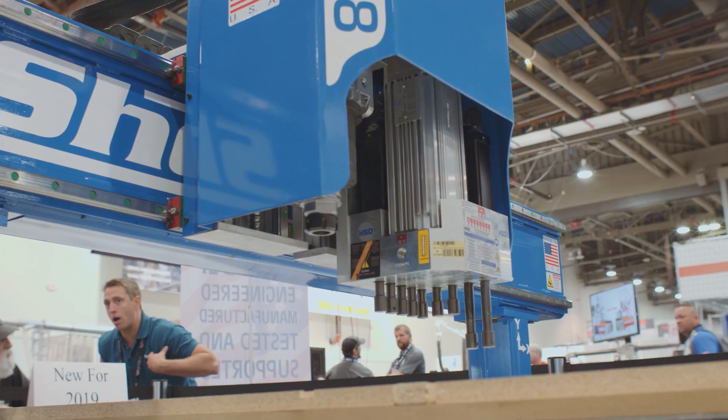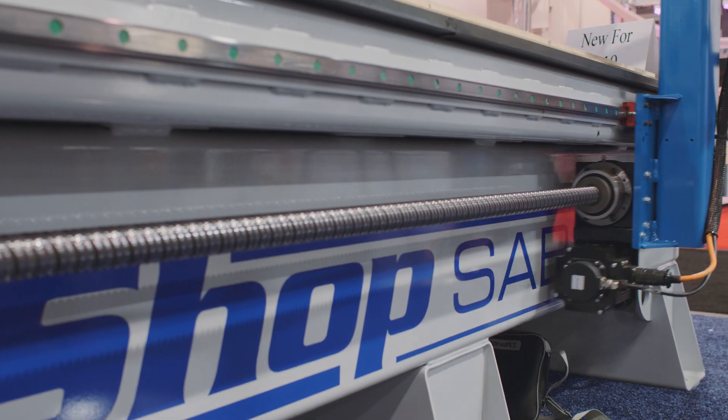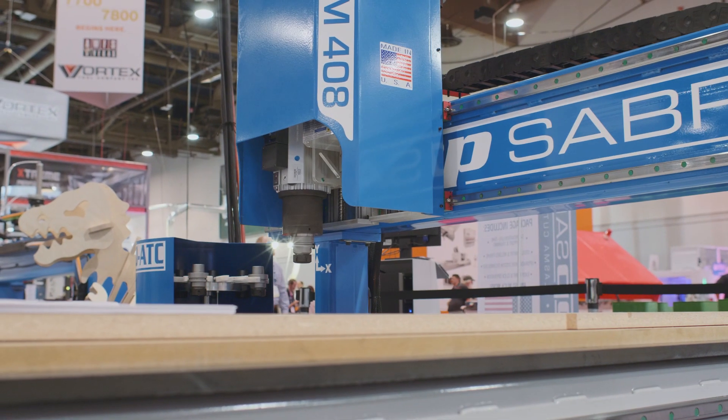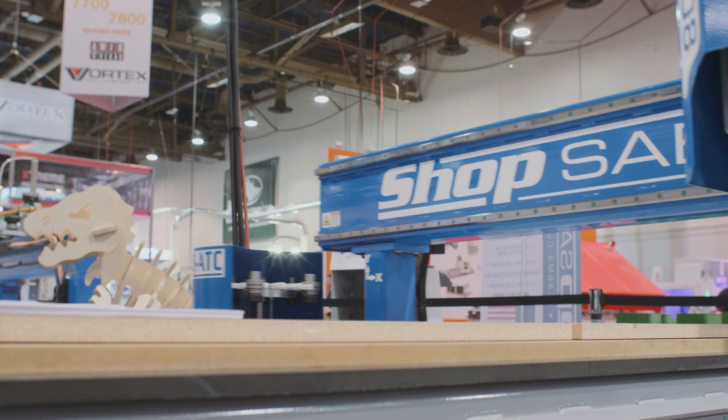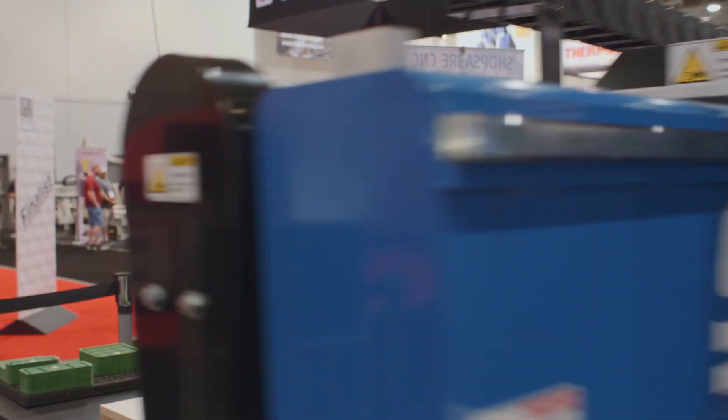How in the world did they do it? It's all about data handling. Think about what you've got in the control — different parts all connected with fiber optic, so the transfer of data in there is lightning speed. Then you go back out to the machine itself and you have the servos with million-count encoders per revolution — that's how much data is being output. Now, when you think about machining, what happens on a machine frame when you get to a certain load level is that harmonics can start forming. Either that limits your feed rate or you have to compensate for it. But the Mitsubishi control is so fast it can anticipate that and make corrections so those harmonic effects never affect the edge finish.